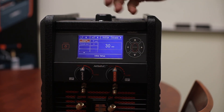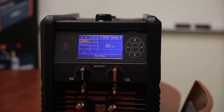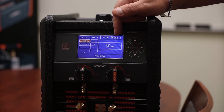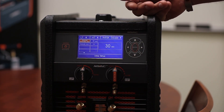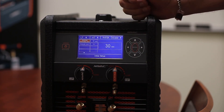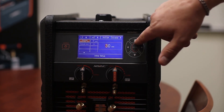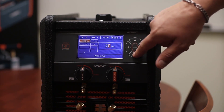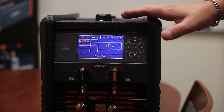The duration of the extended vacuum: because the micron sensor is located in the machine, we know that when we hit 250 — our target — the farthest point in the system is not at 250. So we have a preset 30-minute extended run time. Once it hits 250, it runs for an additional 30 minutes. You can adjust that down to under five minutes or up to 99 minutes. You decide based on your system, the type of oil, how long your pipes are, etc. We typically like to do 30 minutes because we think that maximizes the whole process.